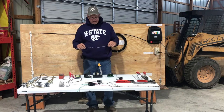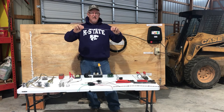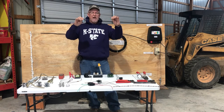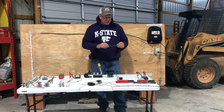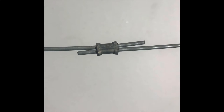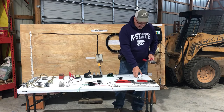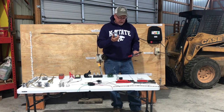Another thing we want to talk about is if you run out of wire. I've seen more wire that's been put together incorrectly — this is not the correct way. Remember, the electricity goes around the outside, so we want to have the best connection we can have. Don't wrap your wire loosely. What I would really suggest is use crimps so you can have a really tight splice. To do that, you're going to need a pair of crimpers. These can be purchased online, and they come in different sizes for different applications. These are the C23 crimps — pretty much the basic standard crimp.